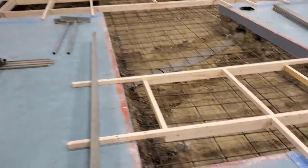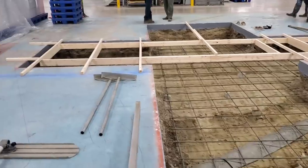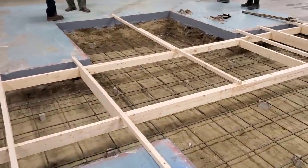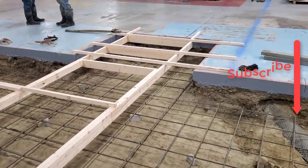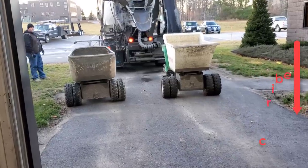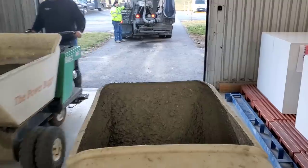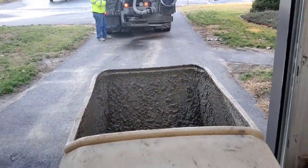This is what we're pouring right here. It's about 300 square feet, about 17 inches thick, it's going to take about 17 yards, and the machine that's sitting on here weighs about 50,000 pounds. That's why they had to cut the floor out and make it a lot thicker. Those areas that are formed up are because some areas need to be lower than others, just the way the paper machine sits on it.